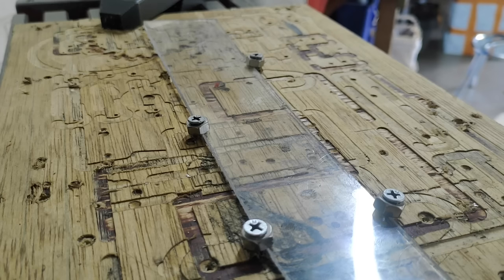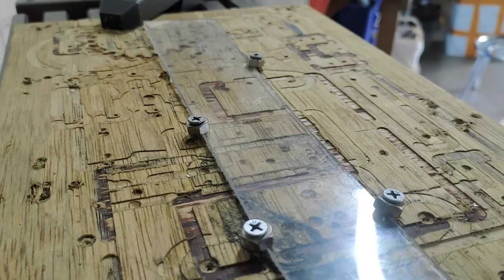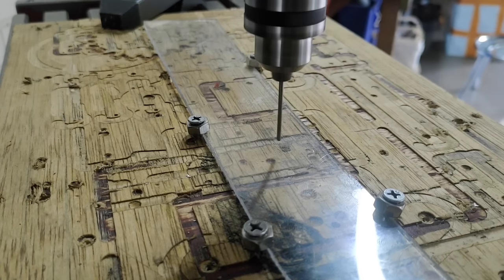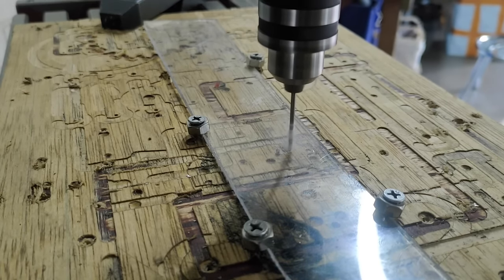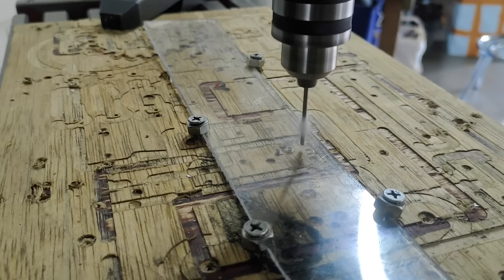The polycarbonate stock is very thin, so I can't go too hard on it, but the part is cut quickly nonetheless. First, the small mounting holes are drilled to accommodate the aluminium blocks attaching it to the chassis. Then the end mill comes in to pocket the material and outline the contour.